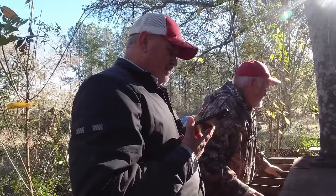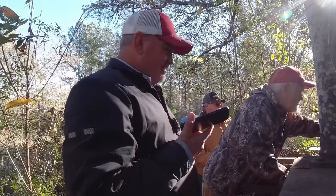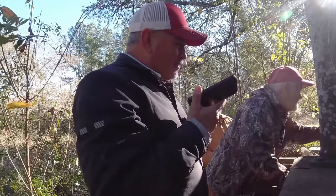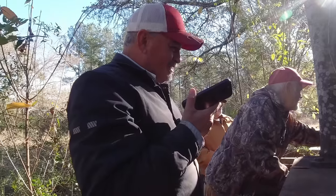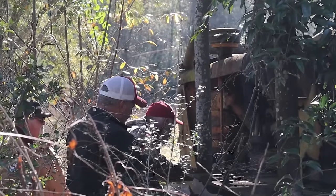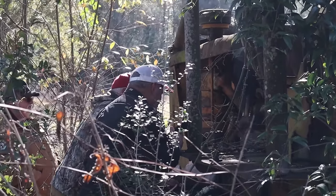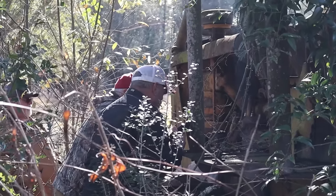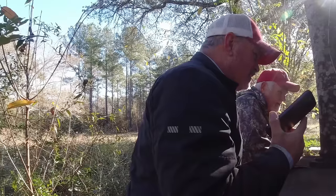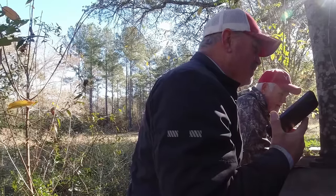Hey, Mike. Hey, good morning. This is Hank Hamilton. How are you? Pretty good. How about yourself? Good. Hey, I got on this starter on this old D8 out here. We're going to try to jump it with 24 volts. I only see two lugs on it. There's one on the bottom of that starter with like a little switch plate on it to connect to the pony motor. And then there's one on the top right side that just has a lug on it. Is that where you hook it up to?